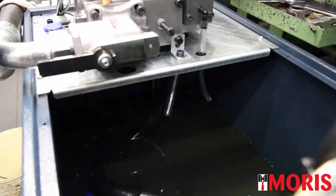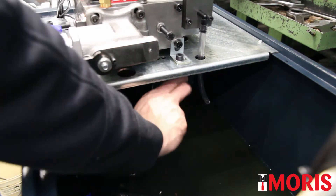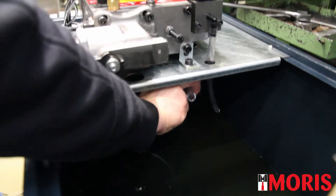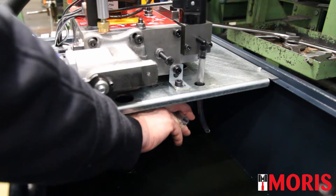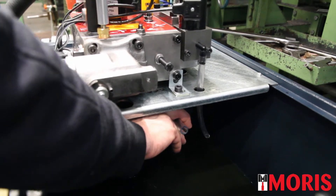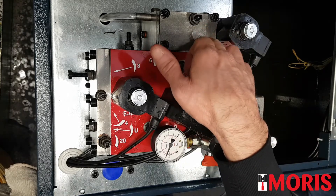Repair steps R2A: oil leakage from the discharge hose of the starting group. If during an up travel oil is coming out from this hose, then there is a problem in the spool of the starting group.